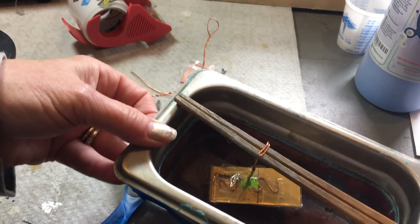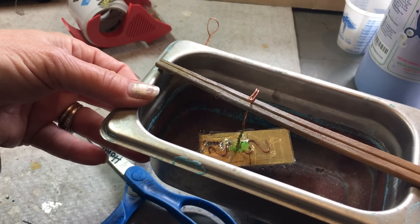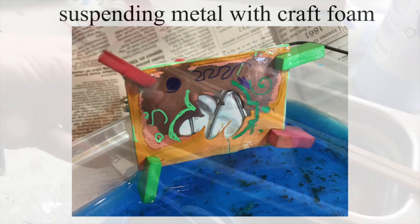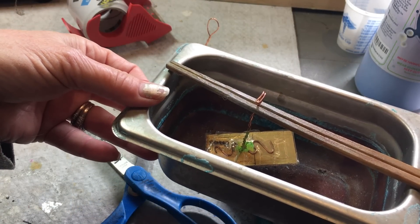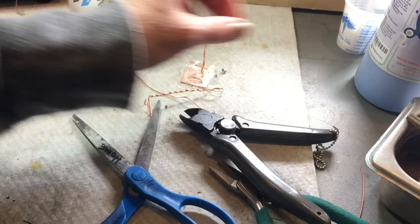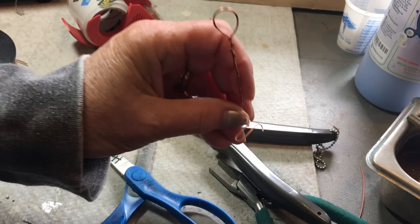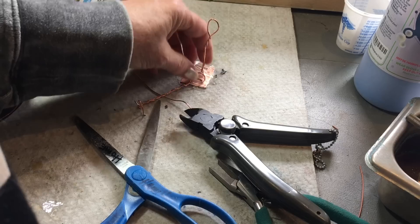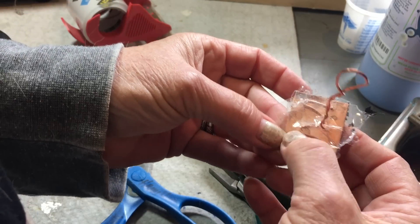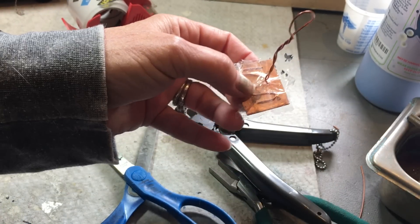In this part of the video I just want to briefly talk about how I suspend my objects. This is the way I've found works best for me. I'm just using 18-gauge wire, folding it in half, twisting it, and making these legs that come out from the side. You can see them on here — they're bent. You want to try to get them pretty long so that the electricity runs through the metal evenly.